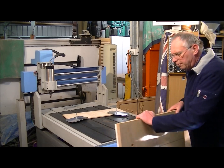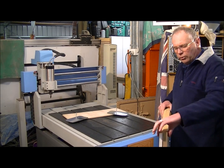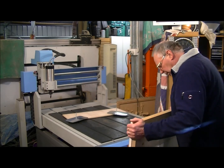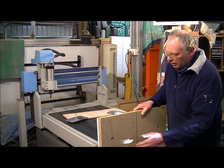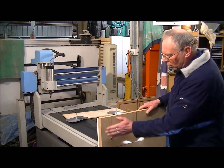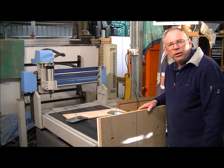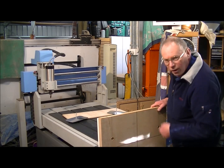We're going to surface the table on a 6090 roto-table. As you can see, this is now quite thick — it's 45 millimeters thick, which is about an inch and a half. What I've done is put some countersunk holes here with bolts, nuts, and washers, and when tightened down, everything is nearly a quarter of an inch — or five millimeters — below the surface, so I can safely machine it off without fear of hitting any of the bolts with the tools.